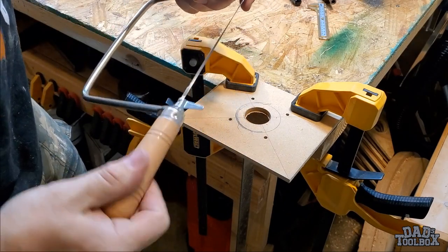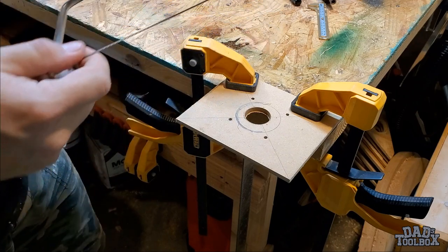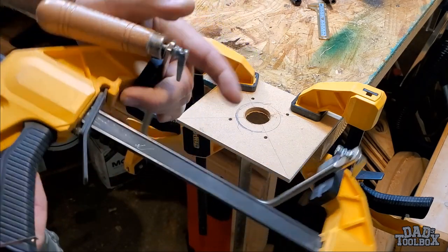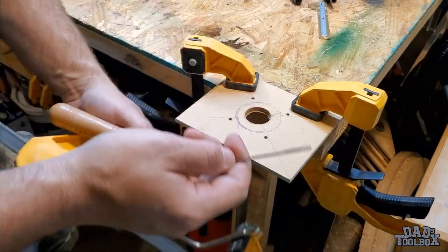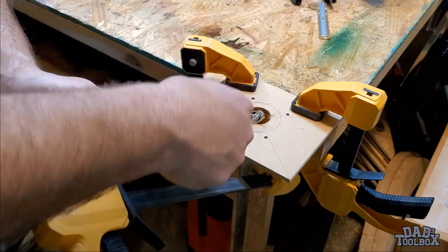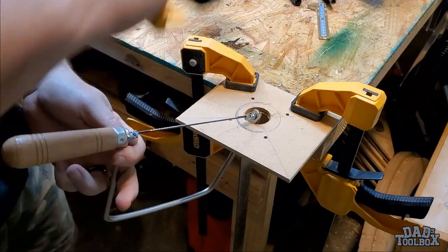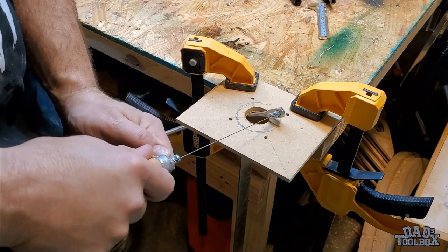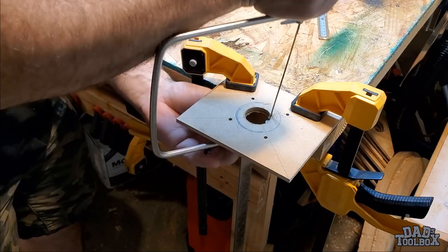So you take this sucker, you unscrew it, you hold it right there so it doesn't warp your blade, and then we're just going to flex it and pull that blade off. Okay, so you can see what I've done here. I use the clamp to hold it in a compressed state, and then we're going to put this sucker up through. And now that I've got it started, I can take the clamp off. I'm gonna make sure to hold that sucker. And now, I'm just gonna saw in a circle. Let's start over here.